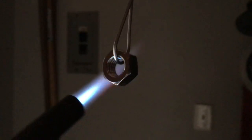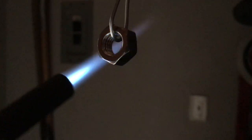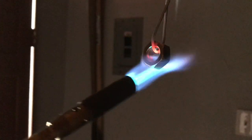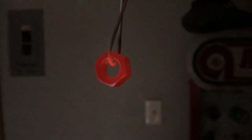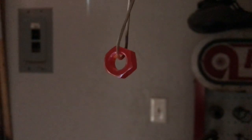With most of the lights cut off in the shop, I'm going to start heating up this nut and we want to just watch it until it starts to get sort of a light cherry red and then we want it to stop. As we can see with the lights off in the shop, our nut is now cherry red, so we will take the heat off of it and let it cool down completely.